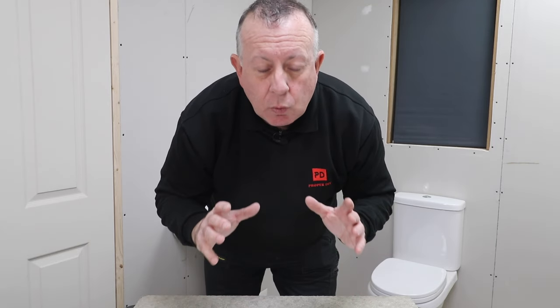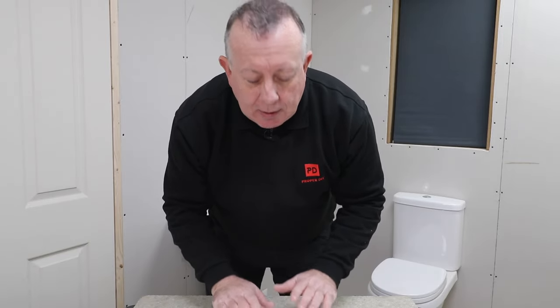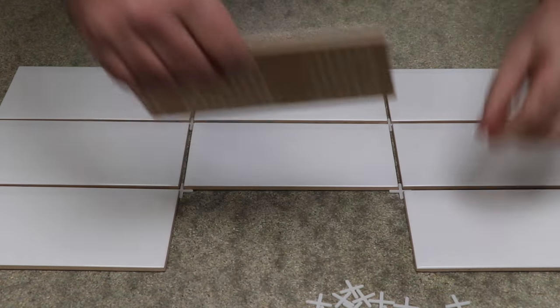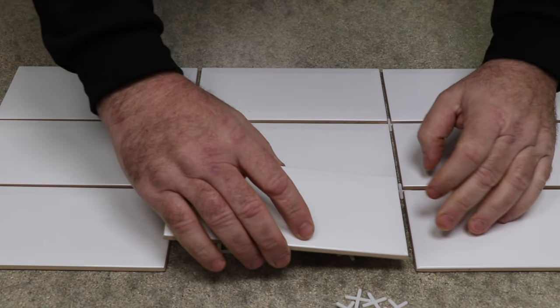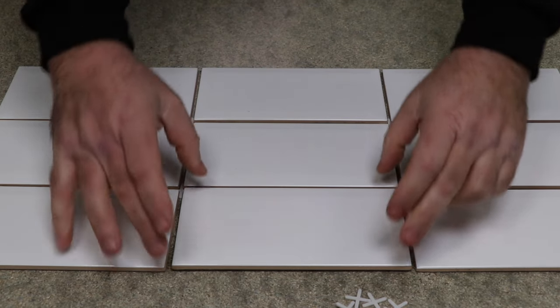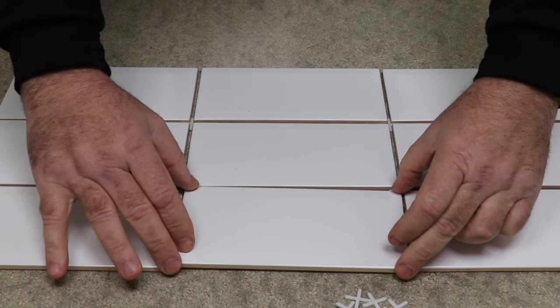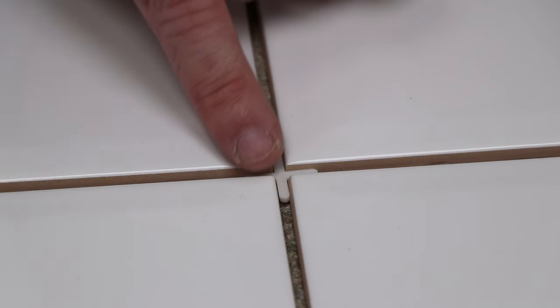There are two or three reasons why I wouldn't necessarily do it this way. Firstly, it's okay on a board like this but the tiles aren't actually touching the wall — there's an adhesive layer between the tile and the wall. If the tile spacer is pushed all the way back to the wall then it's not actually doing anything because the adhesive layer is keeping the tile away from it. Similarly, if the spacer is too far forward near the front of the tile there's hardly any coverage for grout, and that could well pop out in the future leaving little holes in your grout lines.